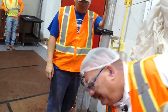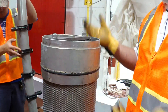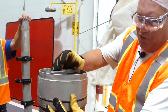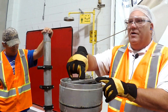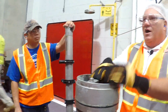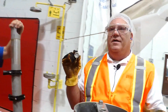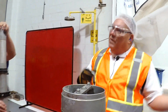This is one o-ring here and the other o-ring is right here — they're both the same o-ring so they're interchangeable. Every six months when you pull this assembly, you just want to make sure the o-rings are good and not stretched or flopping. This is what we call an upper bearing — you want to make sure that this bearing is round, not oval. Check the shaft, the upper bearing, and the lower bearing. Once all that's confirmed good, then we reassemble by doing the opposite steps from how we took it apart.